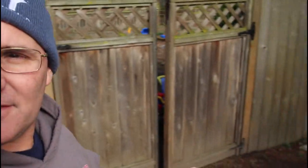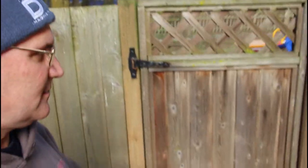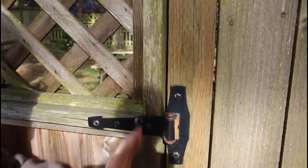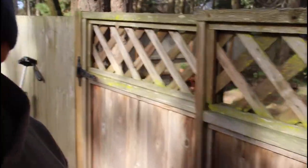The other challenge is the gate hits — see that right there? It's got a tight fit right there, but I've got a pretty good size gap right here. So I'm going to actually take these out, move that over a little bit, trim up this gate, and we'll see what happens. Let's get started trimming the gate out first.